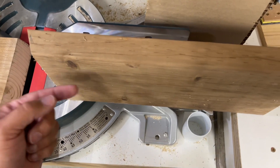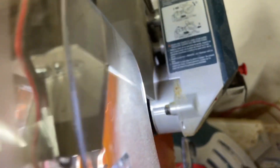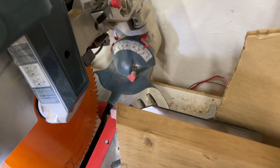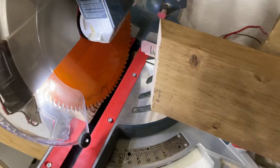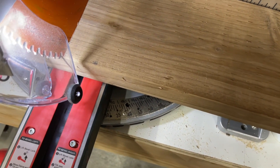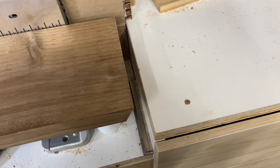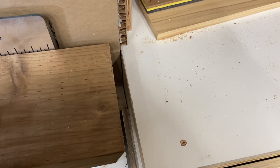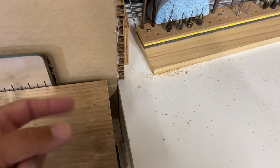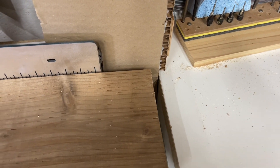We need to figure out how to slide this down the right distance. I'm going to unplug the saw again - don't want anything crazy happening. What we're going to do is lock the saw down in that locked position, and because we know where the saw is going to cut we just attach there. I'm going to put a stop block right here. I thought I might have just enough room to stick a three quarter inch piece of plywood right about there, shim it a little bit, then just butt up and cut - butt up and cut - and bob's your uncle. That first thought didn't work. What did work is just simply opening up my drawer, setting up a scrap piece of lumber right here, and clamping it to the top. It ain't gonna move.